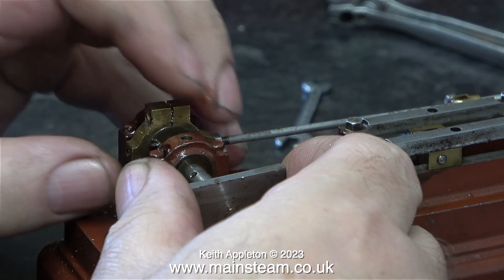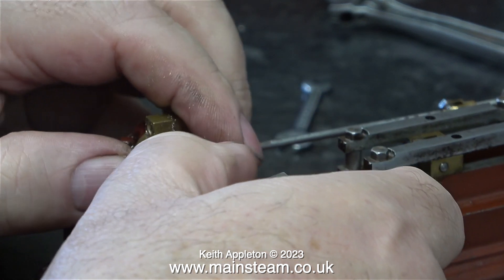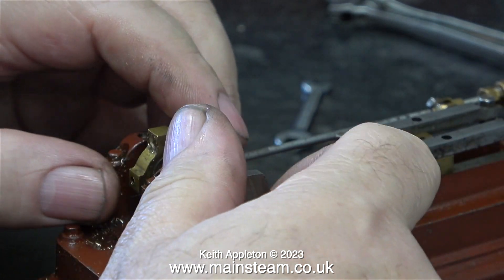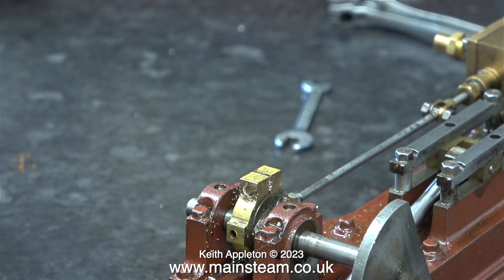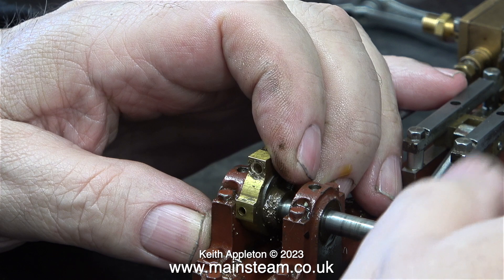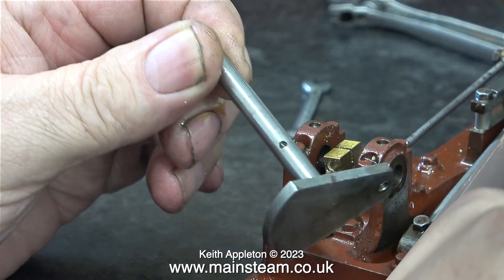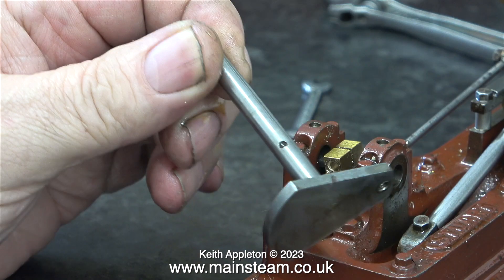This engine was made by a proper engineer. Can you see the little hole in the crankshaft? It's not a hole — it's a shallow depression to accept the grub screw, so that the grub screws do not mark the crankshaft. There's one depression for the eccentric sheave and another one for the flywheel. With the grub screw on the eccentric sheave tightened into this depression, this sets where the timing is. You can see in this next clip how easy it was to withdraw the crankshaft through the eccentric sheave and the pair of bearings, and here's another view of the small detent drilled in the crankshaft to take the tip of the grub screw that holds the eccentric sheave in place.